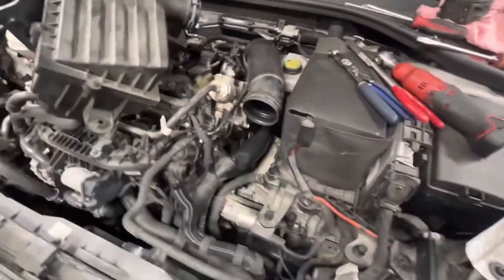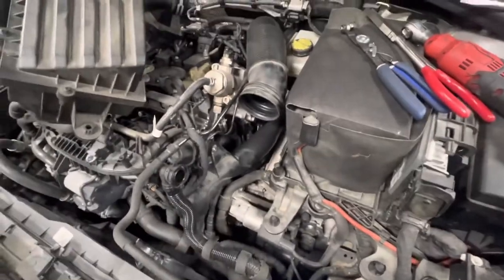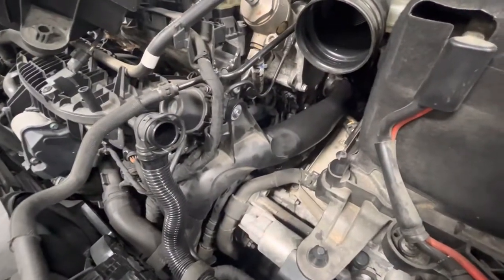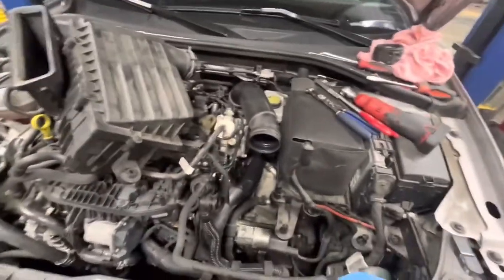What you can do is use a temperature gun — a little laser temperature gun — and shoot it on both sides of the valve. When this thing started producing heat, one side of the valve was pretty hot and the other side was not circulating, it was cool. So replacing this valve will take care of the problem. Just something to look for when you get intermittent heat.